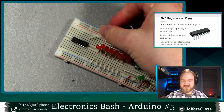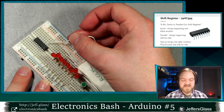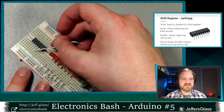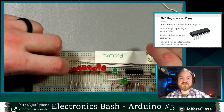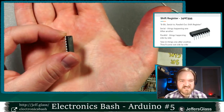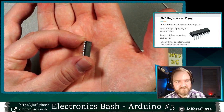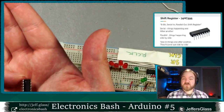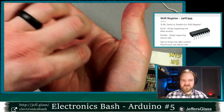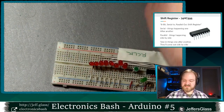So now we can see, remember, the pins on this side and this side of the canyon in the middle here are not connected to each other. This pin is only connected to these four exposed holes just here, and a pin on the other side is only connected to these four open exposed holes over here. So DIP chips are really easy to prototype with. All of them will have either, let's see if we can see it in the light there, yeah, you see how it has this dot in the upper left-hand corner and this notch right in the center there? That dot and that notch are pretty critical to telling you the orientation of this thing. If this didn't have any markings on it, you'd wonder, is this way right side up, or is that way right side up? And the notch tells you something about orientation. We'll look specifically at where that is later.